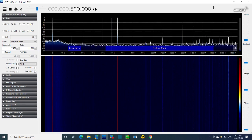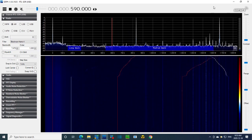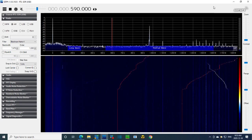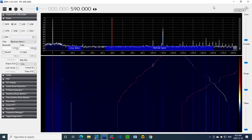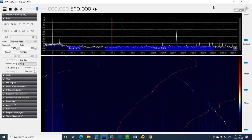So the local oscillator, let's just get this thing. I'm going to put the signal generator on 1,000,000. Now we're going to tune, and we're going to make the local oscillator go past 1,000,000, about 1.1. We should hear it if everything's working. Listening. Oh my god. This radio just worked.